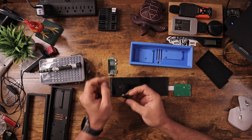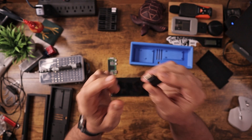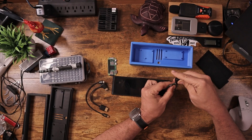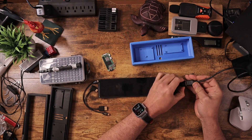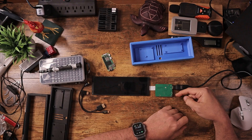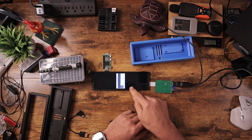I'm going to flip it over. My Raspberry Pi came with this little adapter — it's a full-size HDMI to a mini HDMI, so I'll use that, along with a normal HDMI cable from my laptop. Once I plug this in, it will not work, because HDMI doesn't have the appropriate amount of power to power a screen like that — which is why you have another power port here. Once we plug in the micro USB, the screen should automatically get power, and you can see that it does.